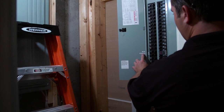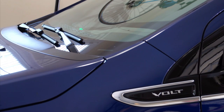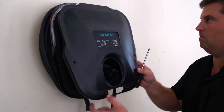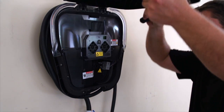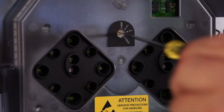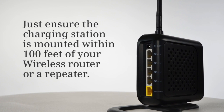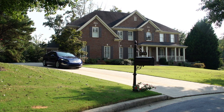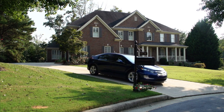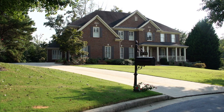Turn on the power and verify the charging process. The amperage adjustment switch is set to max from the factory and only needs to be adjusted if any tripping of the main breaker occurs during charging. Installation is very similar for models with wireless communication — just ensure the charging station is mounted within 100 feet of your wireless router or a repeater. The Siemens VersaCharge is unparalleled in its ease of installation, so you can spend more time on the road and less time waiting around for a charge.